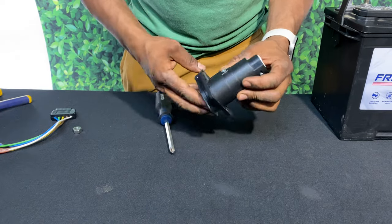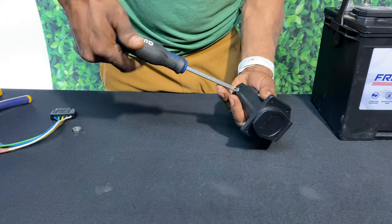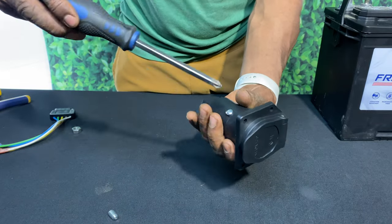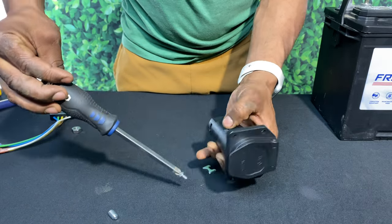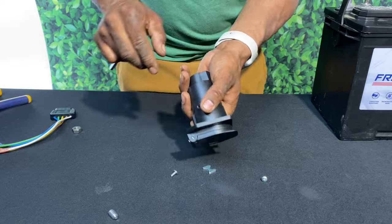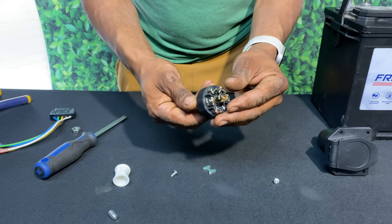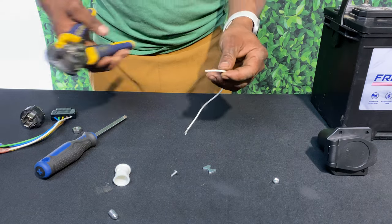Let's take a closer look at this and take it apart. Now that we've got a better view of this outlet, let's start disassembling. First thing I'm going to do is unscrew this lock screw — this lock screw helps prevent the wires from getting yanked out from the entire body in case something crazy happened. These next screws hold the terminal hub within the actual outlet itself. I'm going to give the terminal hub a little nudge and it's going to fall out along with a rubber sleeve that encloses all the wires together.